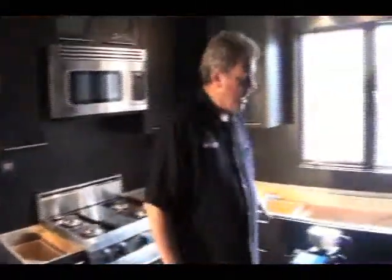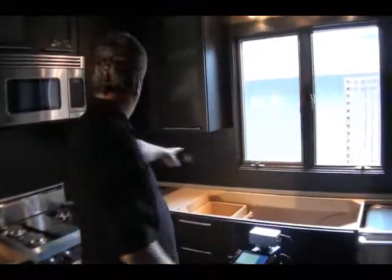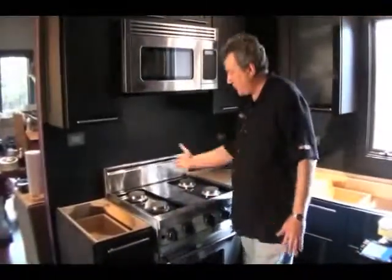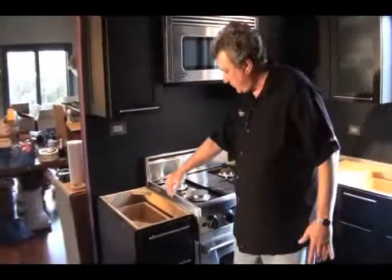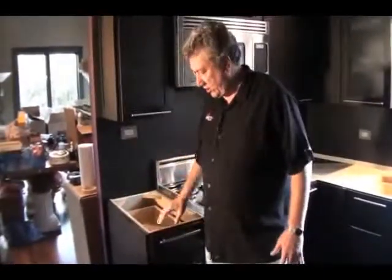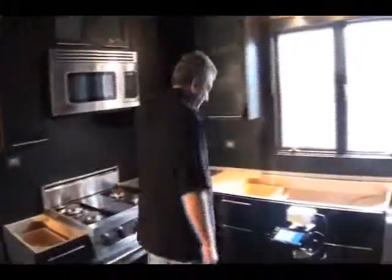We've already showed you shooting the stud shot and the drywall in this room. Now we've got cabinet bases and a stove in, which will confuse the issue a little bit. In this particular case we're going to create a few things where you don't have to shoot them, like this little piece here and that island over there. We'll auto fill out the straight lines, describe the back wall all the way around, extend over the cabinet base to get a nice tight stove opening, and create an overhanged radius box the way the customer wants. Let's get started.